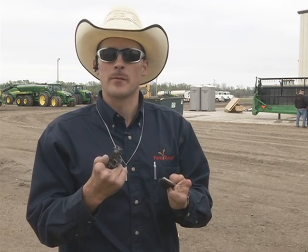After you're done transitioning from corn to soybeans, you'll obviously have these corn scrapers or brushes, excuse me, and you'll have the knockout wheels for corn. I would recommend having a plastic bag either on your side or right next to you, and put the brushes in one bag and the knockout wheels in the other, and make sure you account for 24 of them when you're done so that you don't end up losing them and have to try to find them if another family farmer wants to switch back over to corn again on a future move.